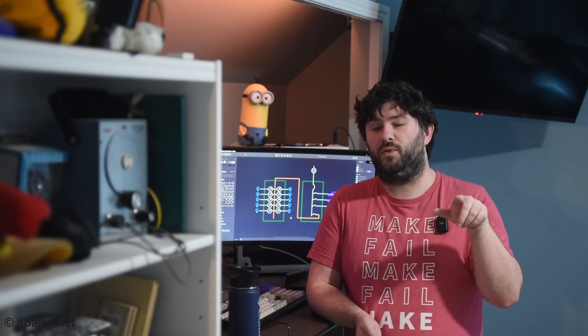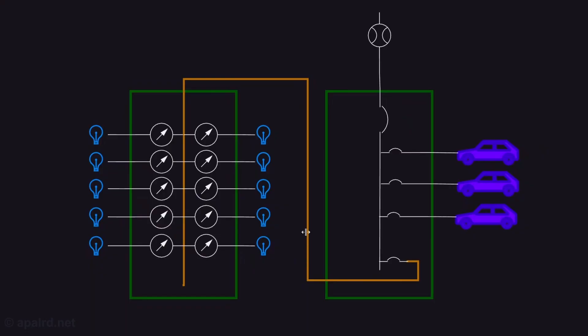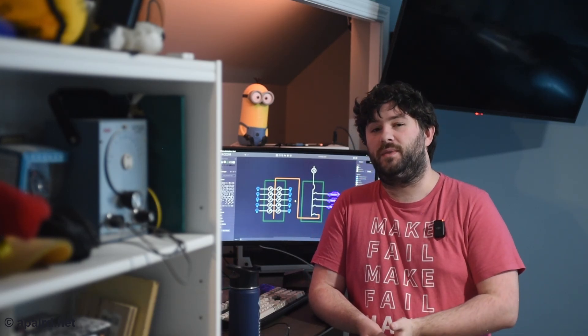By measuring every single circuit in this panel and adding it up, I essentially have a total for how much power is flowing over the orange wire from the sub-feed into the sub-panel. Because I put all this work into having this second sub-panel fed by the orange wire, I can now essentially cut that orange wire and add an inverter or battery system there to power everything in the second panel. That obviously won't include the car chargers or the air conditioner, but that's my intent. I really want to find an inverter that can splice directly in here with about a 60-amp transfer capability, since this is a 60-amp sub-feed — perfectly adequate for the amount of load I have here.